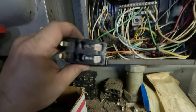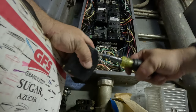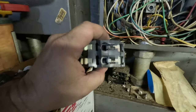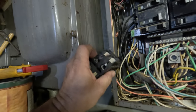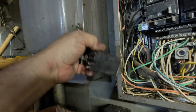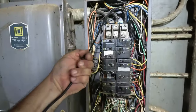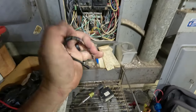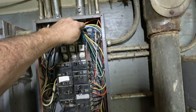That one there looks clamped down nice and tight, but the wire was maybe behind it — that probably had a little something to do with it. The clamp is completely tight — there's no way that number six wire was fitting underneath there. It literally is not underneath there. You can tell that prong ran a little bit warm. We need to check the wires and see how far back it went. Went ahead and chopped it off there, pulled the other one out. Nothing wrong with this one — no discolorations on the wires at all. This one, as I was bending it, it just crinkled. It starts to get good wire where I chopped it.